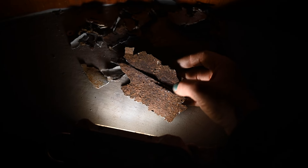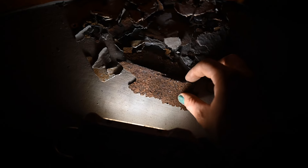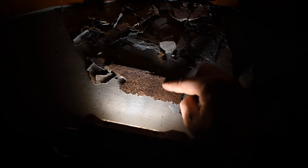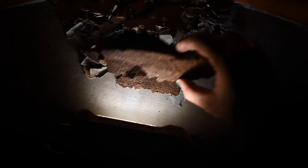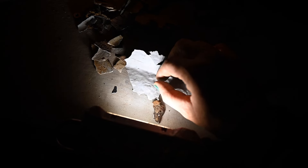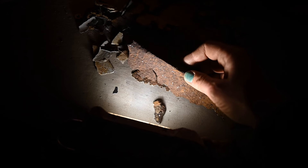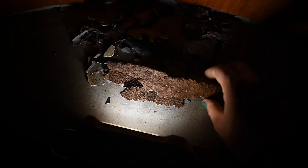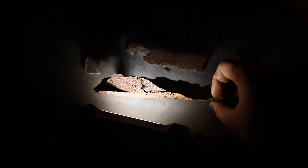You can see it looks like paint on one side, and then you flip it over and it looks like rust. So this was painted without the surface being properly prepped. We believe they used grinders and wire wheels and other tools that just did not give that surface the right texture for paint to stick to it. Because of that, we ended up with rust underneath all this paint — and it's pretty thick. There's also a possibility that they painted over it without cleaning up all the rust properly, but yeah, it's everywhere. So clearly, water or moisture of some sort was getting underneath there — it might have just been condensation. Because the paint wasn't stuck to it properly, it got under there and it rusted. All of that was hidden underneath paint.